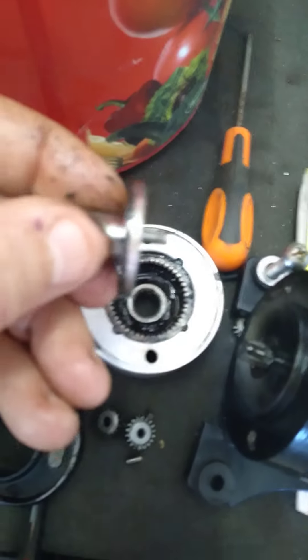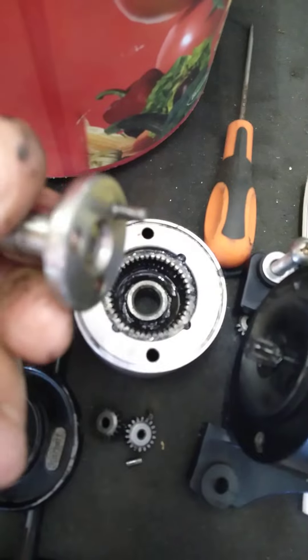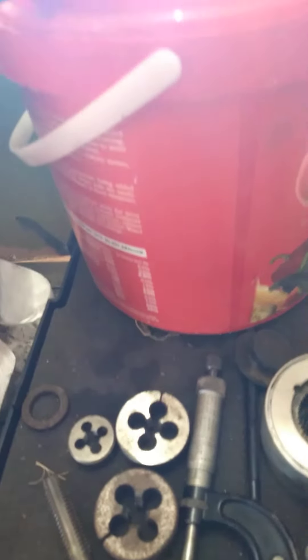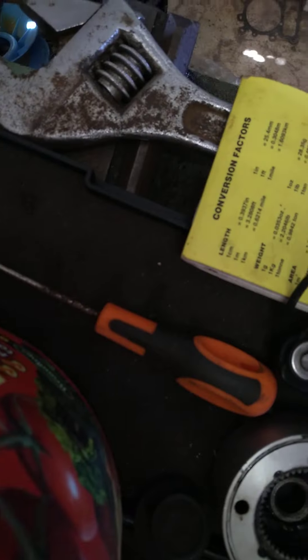So that's a new pin that I've just made. And put it in there. So there's a little gear. That little gear pops onto that shaft. So I've had to make it — that's a bigger diameter there and press it in, in the back. So then that shaft goes on there.